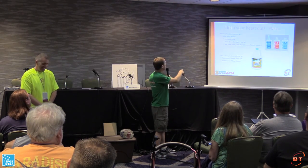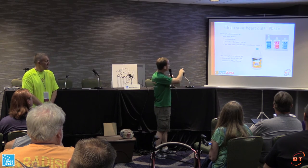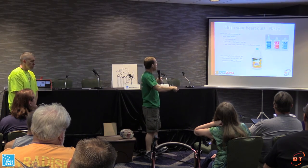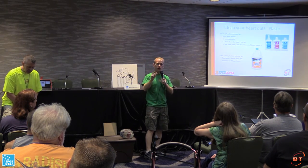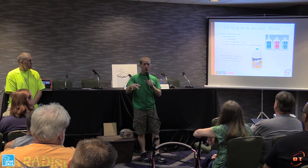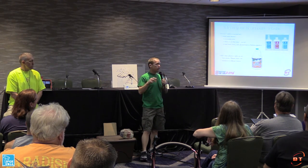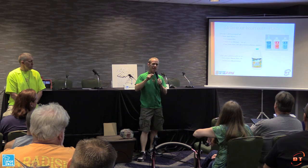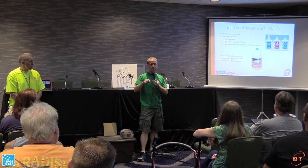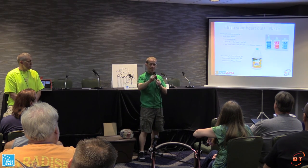Yeah. So plastics. Novus here again on plastics with art, like your slingshot plastics and all the playfield plastics. I'll do a number one on the underside, spritz it, clean it off. And if I've got something that's really brown, like from nicotine or like it came out of a bar or it was on location, I'll use a little Windex. And you just test it, because I'm sure that somewhere somebody's going to have a plastic that it's going to eat it. So take something in the far back of the playfield where you wouldn't see it and test it.